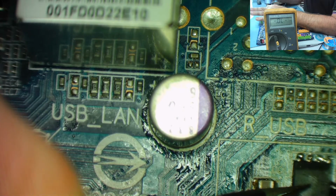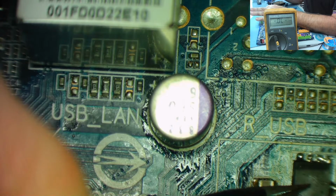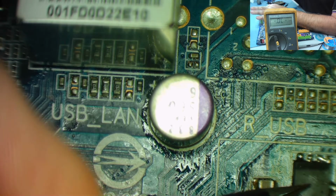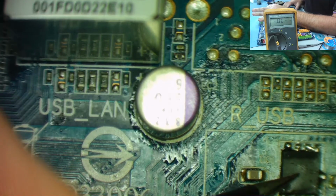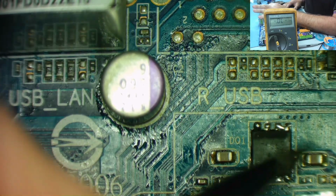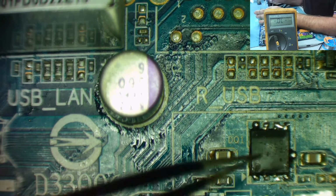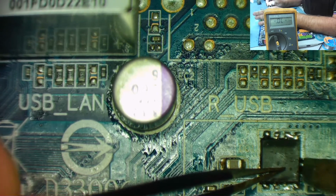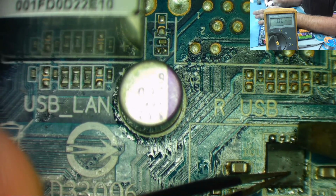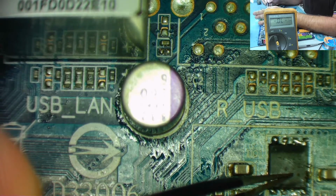Yeah, you see it go. You see all the solder melted, yeah? It's actually squirted out a little bit at the side. We can see it, just clean that up. So that's basically the way I do them. No doubt other people will have their own slightly different methods. It doesn't matter there's a short there because all these 4 pins are connected together anyway.